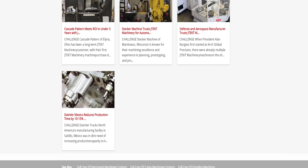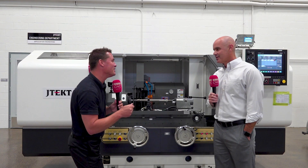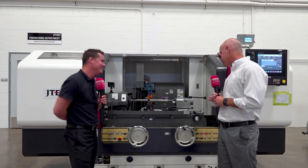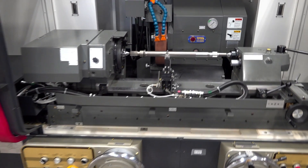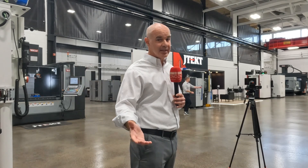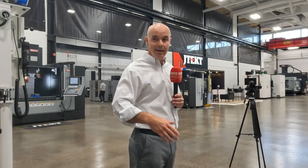As an industry we're promoting automation and upgraded, user-friendly software, and I want to go into your Windows-based software. But first — these wheels right here. We have a generation of people that like the feel of a manual machine, or maybe they only have a couple of parts to run and not a big batch. This is our Pro specification. It lets you use the machine like a manual or hydraulic style machine, but with a CNC in the background. For an ultimate lot size of two or three parts, you can wrap it up quickly, set your datum, hit the position memory button, tell it how much stock to take off, and you're off and running.